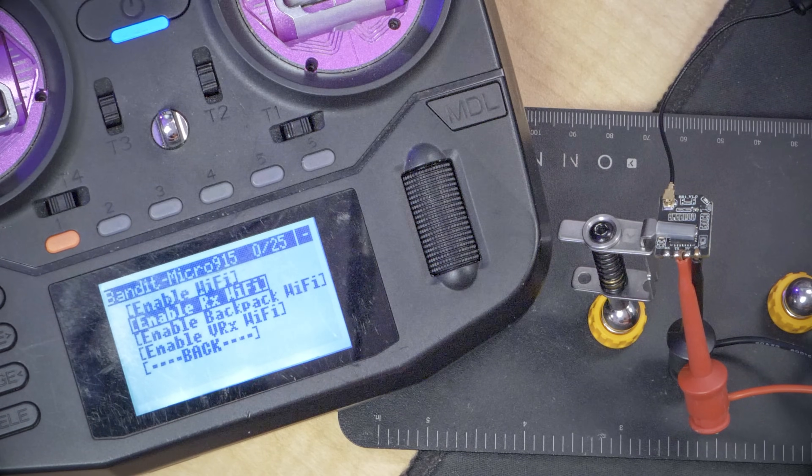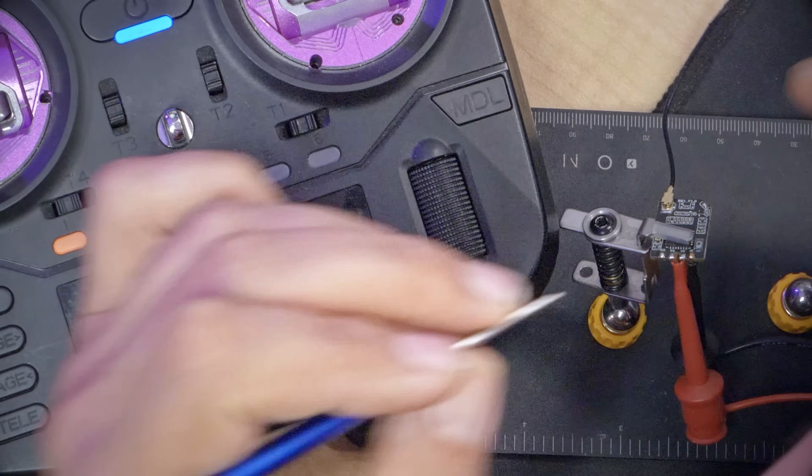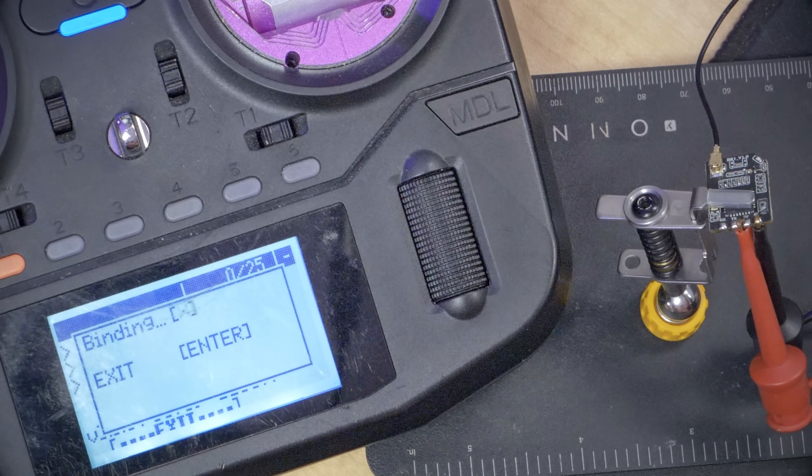That is going to break the bind between my radio and this receiver. Now if we power cycle, the receiver will come up with a single red blink, meaning it is waiting for a connection from the module that it's bound to — but there is no such module with that bind phrase. Instead, we're going to rebind it using the bind button. So I'm going to press the bind button down for about two seconds until the red LED begins double blinking. And you can see here we are in binding mode. Then we just repeat that binding process just as before — here in the Lua script, we go down to bind. Bada bing, it's bound. Now it's bound to my radio. So for those of you who have been waiting for a simple bind button, an easy way to bind ExpressLRS — now you finally have it.